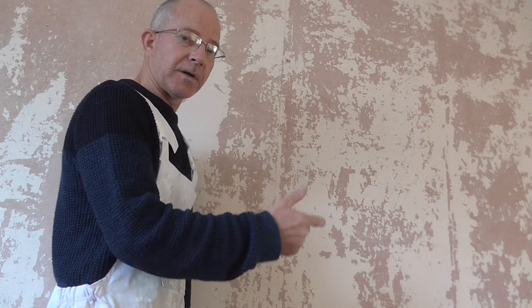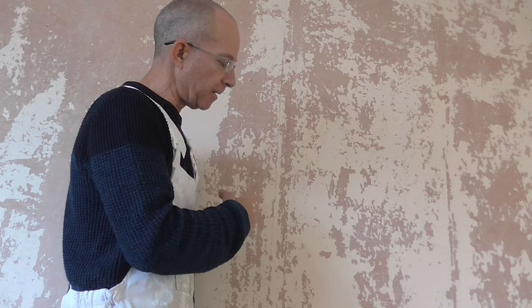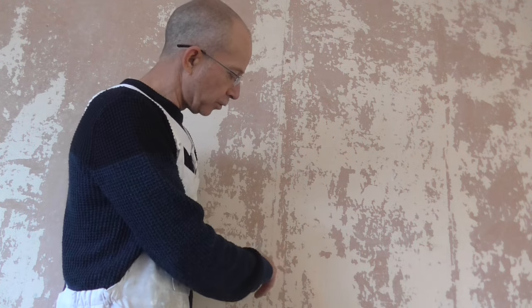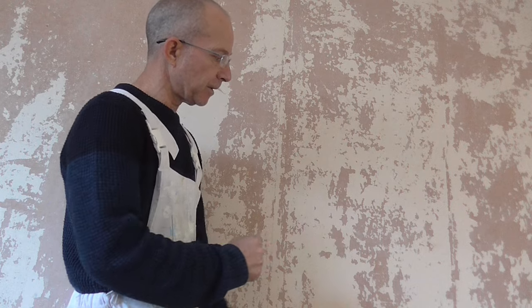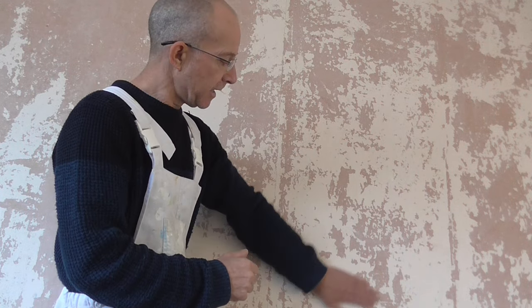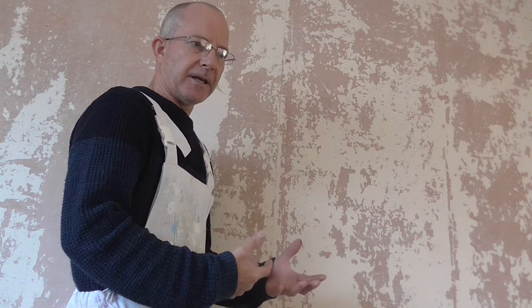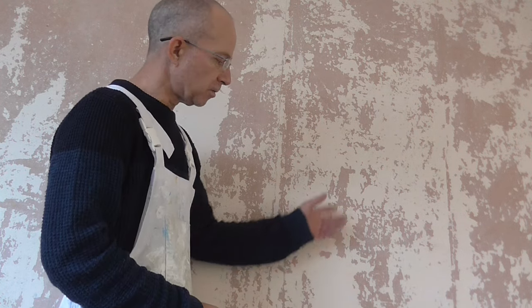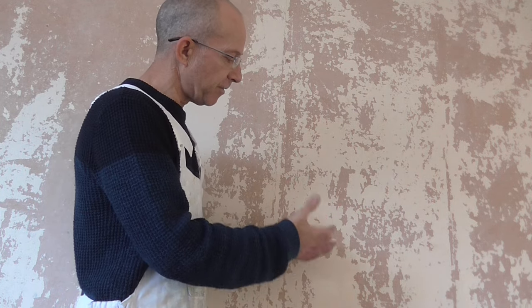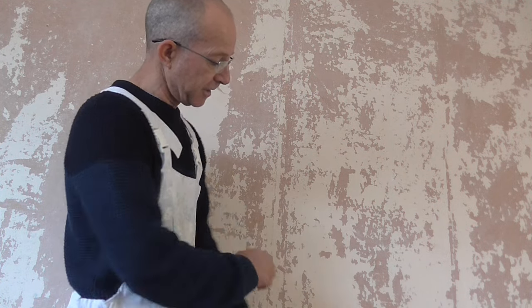So I'm lucky on this job because I'm actually putting wallpaper on the wall, so it's going to hide a lot of it anyway. But if you were going to paint this, the first step, which should already have been done really, is you've washed off the wallpaper paste. Wallpaper paste is a substance that once it gets wet, it goes soft again. So you wet the wall, leave it for 10 minutes, wet it again, and it'll all just start coming up as a gel. And you wash that off,